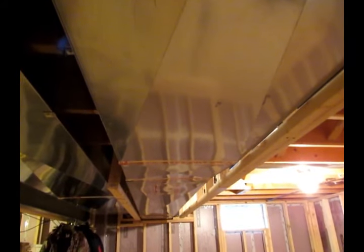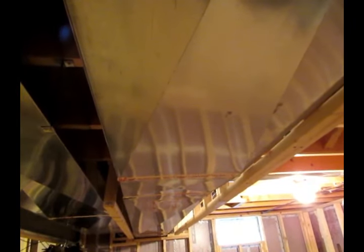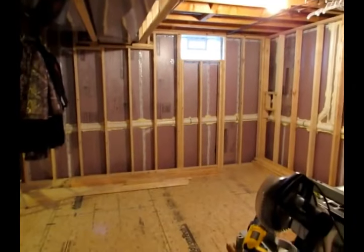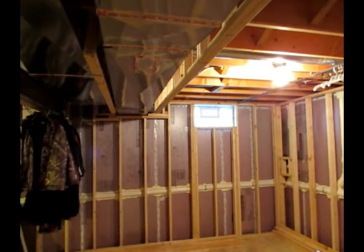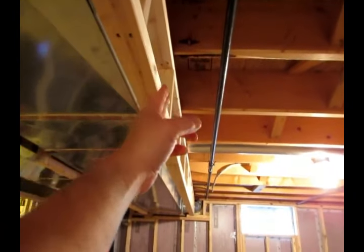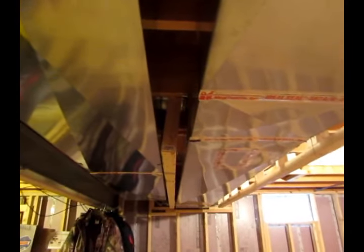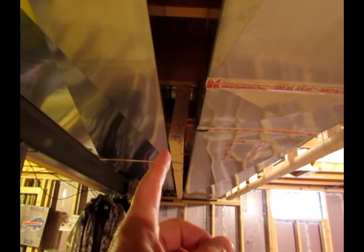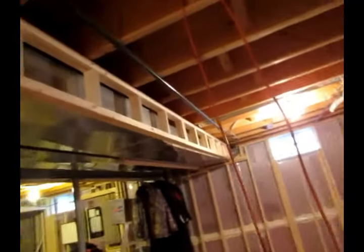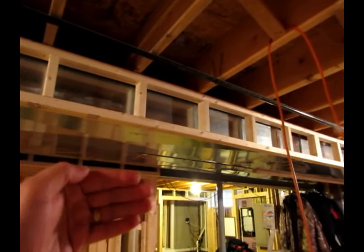One thing I'm dealing with on this project is some materials that won't line up exactly where you want them to be. They're not firmly secured on both ends like a wall, which is fixed at the floor and ceiling holding it in position. In this case, these ladders are suspended — they're just hanging there. While we do have them fixed at the correct position on the joists, these bottom ends are somewhat free to move either way. Some of these are also bowed a little bit. As you see in this middle section, since it's going to be hidden, it's not such a big deal. But you can see how this bottom plate here is actually warped a little bit to this side, and we want to get that straight.